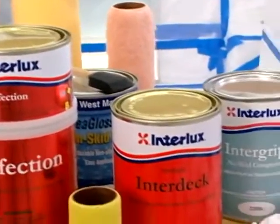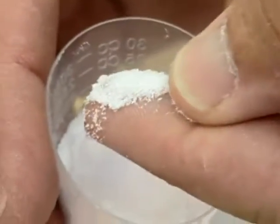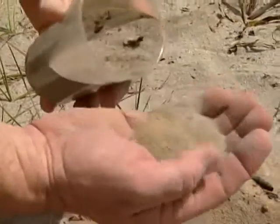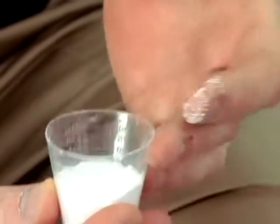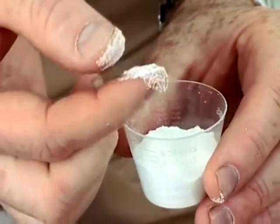The difference between a one-part and a two-part polyurethane: one-parts are easier to apply and less expensive. Two-parts are more durable and cost a bit more, but they don't come with non-skid already mixed in, so we have to do that ourselves. This non-skid is a white, beady type of material that gives you traction. As for why not just use sand from the beach — this is a polymeric synthetic bead that absorbs the paint and becomes sort of one with it. Sand will settle down into the paint film and won't be as uniform. This material remains in suspension better and gives you a much more uniform finish.